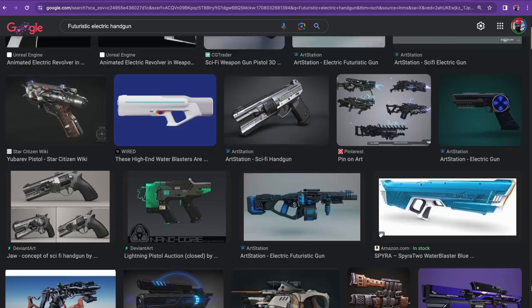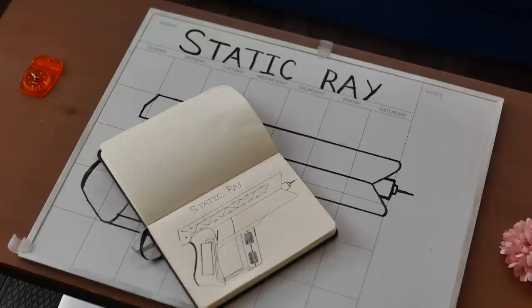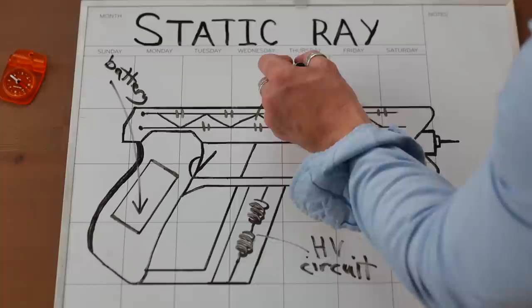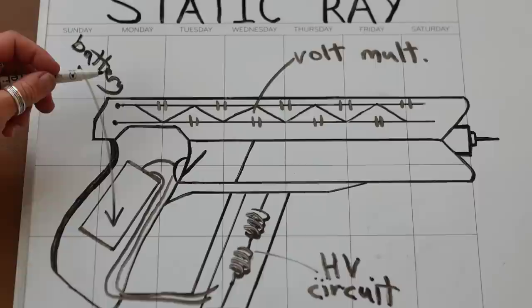This is a sci-fi idea, so it needs a sci-fi look. Browsing through various examples of futuristic designs, I drew a lot of inspiration from several video games and ultimately decided on blending a few designs into something more suitable. In the handle is a rechargeable LiPo battery; in the front of the grip sits a dual high voltage power source; and up top is the main workhorse responsible for the voltage production. The wiring to the switch and high voltage power source should be pretty easy. However, there is a dilemma — how the high voltage is fed back to the multiplier without getting in the way of my hands is kind of a mystery. The physical dimensions of the voltage multiplier and the high voltage circuitry were hard to predict, and they would determine the dimensions of the entire project. So before designing the gun proper, I needed to first build these components.